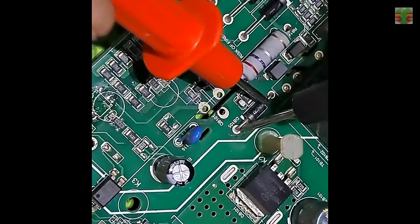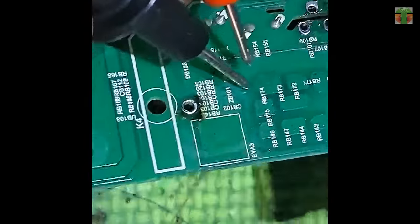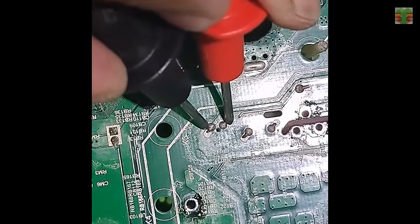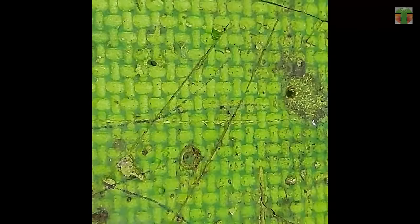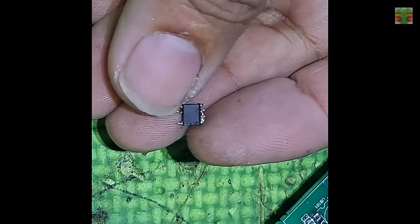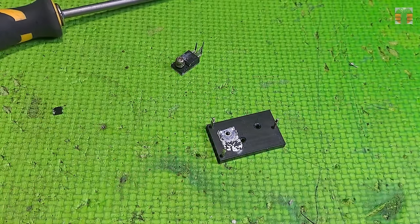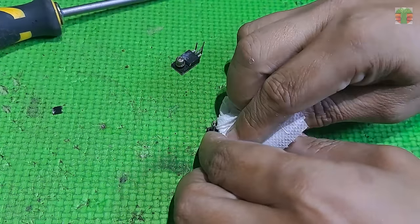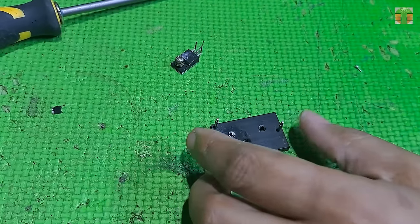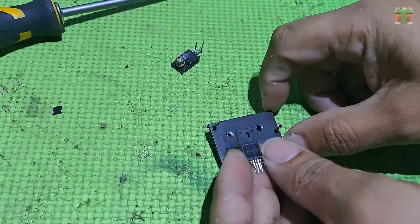The rectifier diode is not shorted now. And also the filter capacitor. So the PWM driver is the shorted one. I don't have that PWM driver to replace it with. I want to fix this TV right away, so we will modify it again using the STRW6053N.